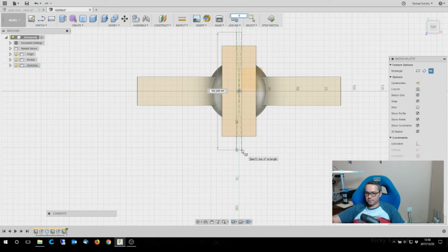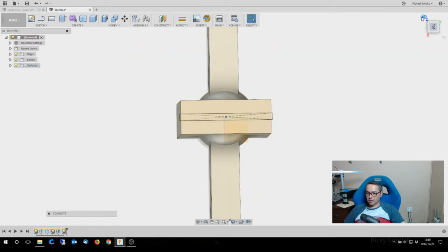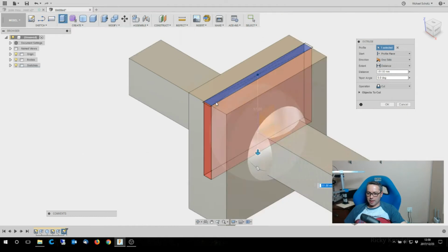and I'm going to make it, let's go with 4 millimeters there, so it's got quite a bit of space to move. In fact, let's see, 6. It's kind of on that line of where it might start deforming, but I don't want to end up with it having not enough space to actually clamp down. Because I'm going to cut that other area out, I needed to clamp more, so that should be fine, and 82 will give me enough. All right, so stop that sketch, go back here, select that, press pull down is now going to cut.